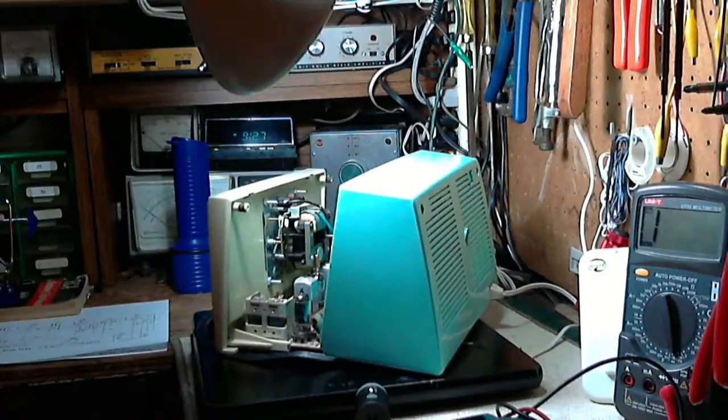And the effect in the radio when the short occurs sounds to me like the RF is being removed from the front end of the radio. And that sounds like the other plates are shorting, which essentially shorts out the front end of the radio completely. So we managed to add some more evidence that the problem is plates. We now know which side of the capacitor it is.